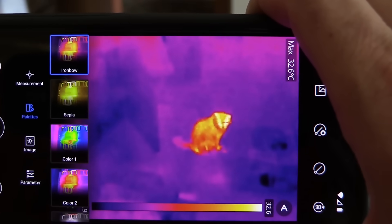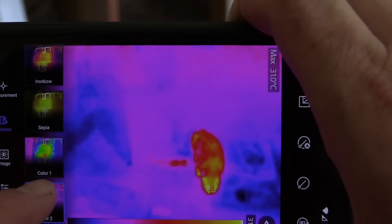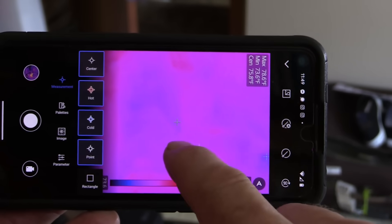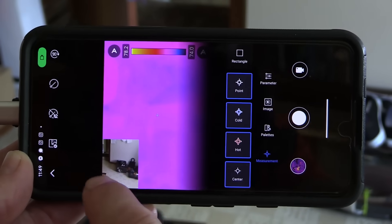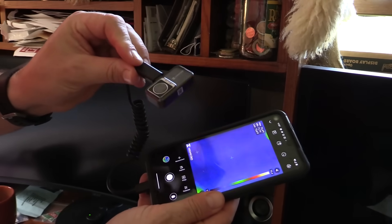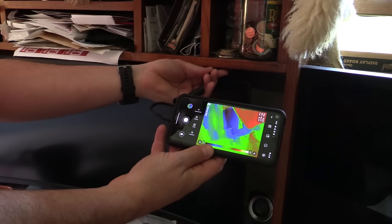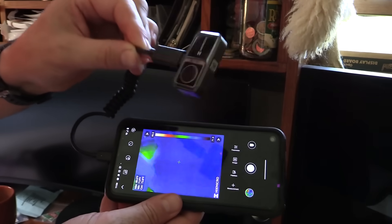As with most thermal cameras, we can choose things like our color palette if we want to bring out different features in the environment. We can also see a charging power brick and a battery pack over here — it's really interesting to see just how warm those power bricks can get. If we get tired of that auto calibration message constantly popping up, we can actually turn it off, and we can also manually calibrate with this button. We can also do a picture-in-picture using the cell phone's built-in camera, and we've got an album right in the app that shows us our captured images. The extension cable option is not just a gimmick — this is super useful. If I want to get into an enclosed, tight space like behind my computer monitor and look for hot and cold areas — maybe I smell a burning smell and I want to know if there's a wire overheating — we can stick this under the furniture, behind appliances, up in the ceiling, in holes in the wall.